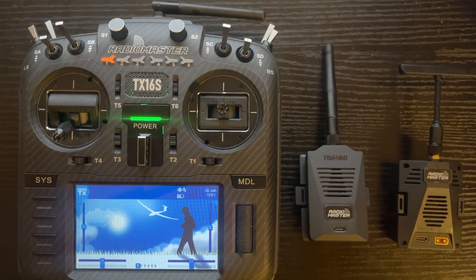The last option to consider is setting up wireless trainer. The TX-16S has one module internal, and that allows it to send or receive. Setting up a wireless trainer, the radio will receive with that module, but you need something to output to the aircraft. You can use DSM or FrSky protocols to connect to the TX-16S, and when you go to the aircraft, that's going to follow the same rules as earlier — if it's a legacy receiver you'll use the 4-in-1 module, and if you have an ELRS receiver you'll use the ELRS module. Just think of it as: the radio can connect in, and then depending on the receiver in the aircraft, you go with the 4-in-1 or ELRS.